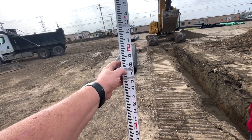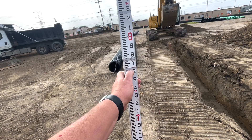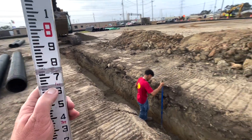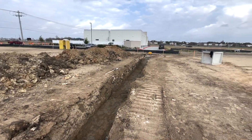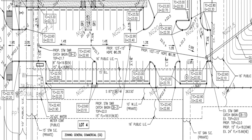We're required to have six inches of stabilizer, so the next mark will be the top of the stabilizer, and this mark is the flow line of the pipe. The laser is already shooting the right slope. Let's look at the scenario on the blueprint and show you where I get these numbers from.